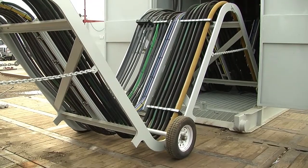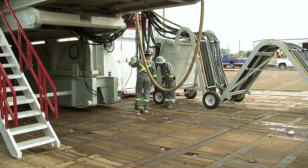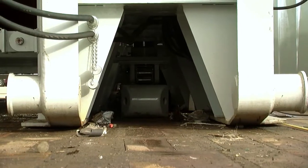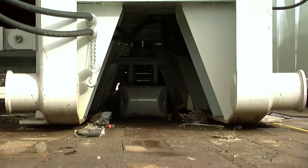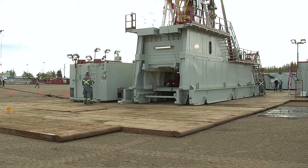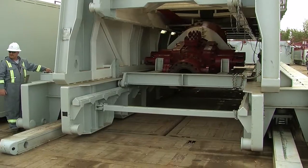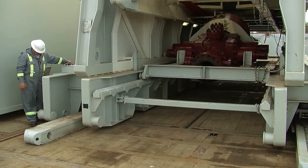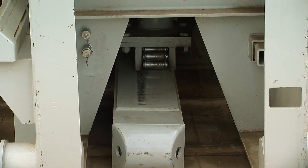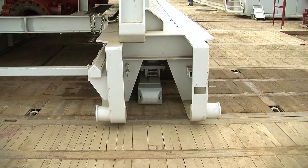The cable crawler is the first for us to be able to walk the rig, leave it plugged in and operating. The rig basically moves on two rails — it's jacked up on Hillman rollers. The Hillman rollers are on rams, so the rig is jacked up first on the Hillman rollers and rams, and then it's moved along with cylinders on rails. It's a very simple design. You can move it on the x-axis or y-axis by moving the rails either through the sub or along with the sub.